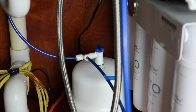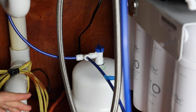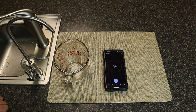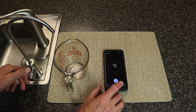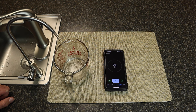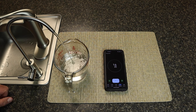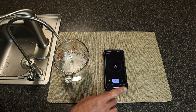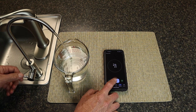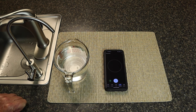Like that — and now it'll bypass the tank, just like we didn't have the tank connected. I have my stopwatch reset, the valve on the pressure tank is off so it bypasses it, and let's try this again. Now it's strictly dependent on the pump. Okay, so that took 26 seconds, almost 27.